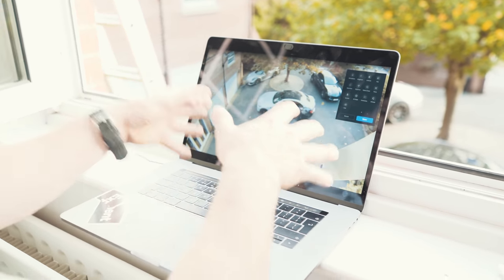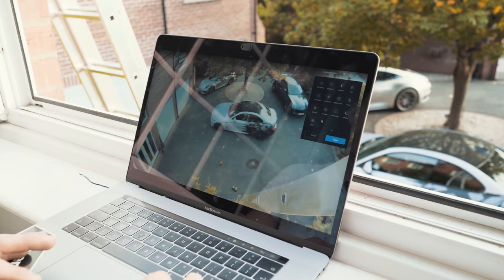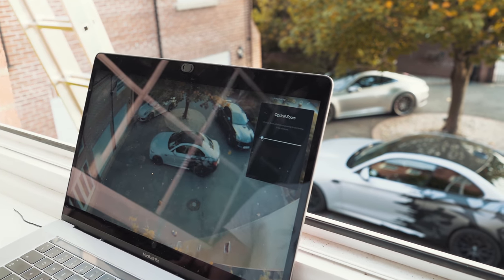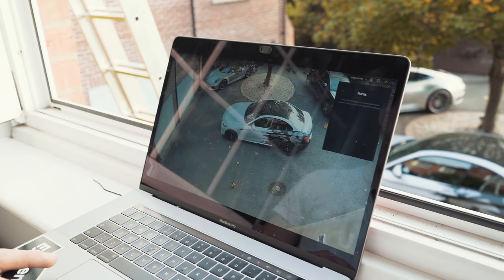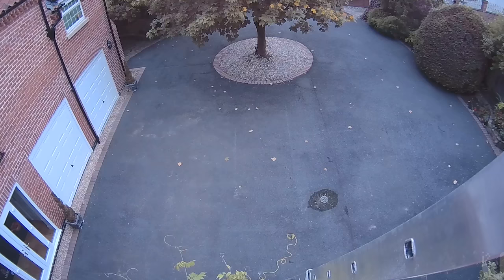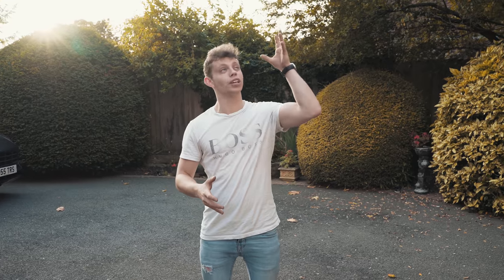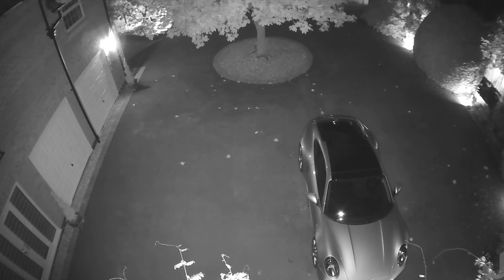As you can see, this is our camera. It's super blurry at the moment, but that's because with these cameras you have to go in and set focus. They have an optical zoom, so I'm going to zoom in a little bit and then set focus right in the centre — which is my car — and that will mean that point will be where the camera grabs focus, and now you can see it's pin sharp. So, much like I said, it's going to be rinse and repeat. This property isn't just going to have one camera. We're going to be installing cameras on the outhouse with a point-to-point link, and on this house I just need to run more cables up into the loft and install more cameras for more security.